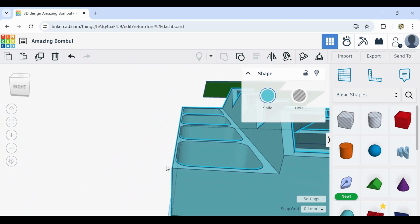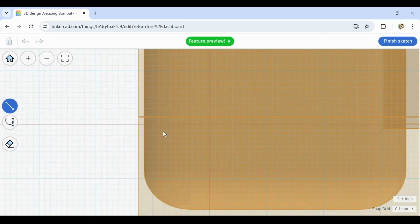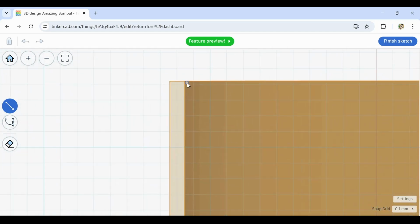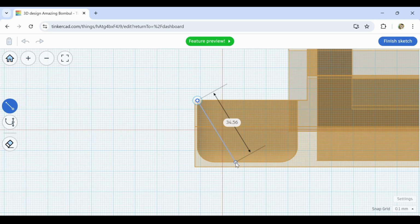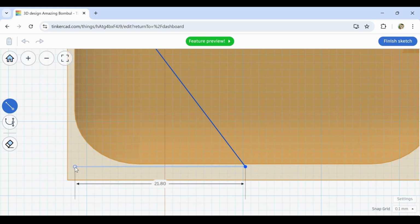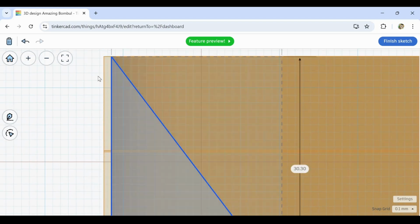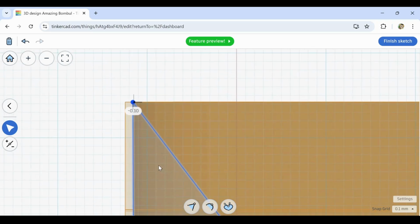You know what? Let's try something, guys. Let's use the sketch tool and add a ramp in there, because then you could slide the coins up out of there. That's how cash registers worked in my day. So what if we start there? And where do we want to ramp to? Way over here? And then we got to make sure we're back in there, in the plastic. I wish I was over a tiny bit. Oh, we could do that now, though. So let's move this over slightly like that.